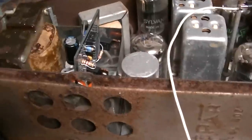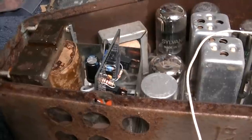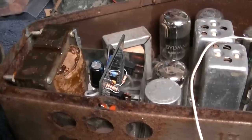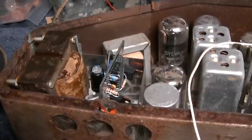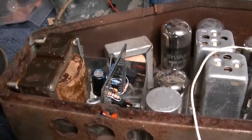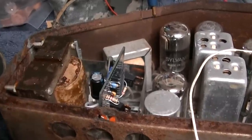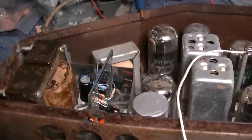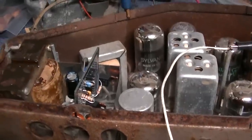My summary of this: I think it's a clean circuit and I think it works. I don't know how long it's going to last. I don't really like the diodes to lower the voltage - I would like the vacuum tube rectifier, which I think would probably do a better job of lowering the voltage. But in part one we discovered the vacuum tube rectifier, the 0Z4, is garbage. So we went with solid state diodes, which are much more efficient. But the circuit works - the B+ is just a little bit too hot.